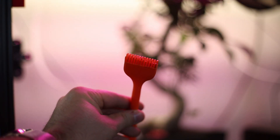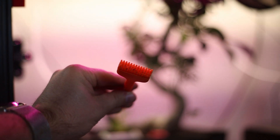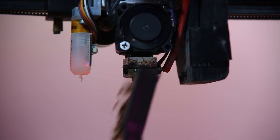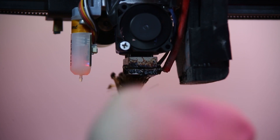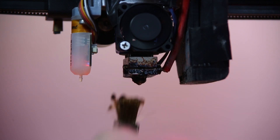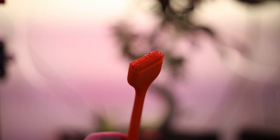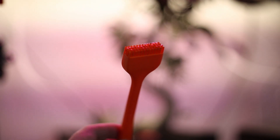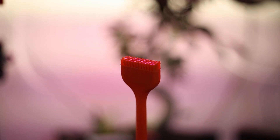As you can see here, after brushing, we did actually get some material off. I did a couple tests with a brass brush just to see if it would remove any more material. In this case, I've got a bit of baked-on stuff that I may have to take a blowtorch to or use a scraper with afterwards. But in general, I ended up with a lot more material than I thought I would coming off the heat block. This is why we want to heat it up to the PLA melting range — because most materials will be soft and have some form of malleability when they are in that melting zone. The goal is to scrape it off and yank it off the block in the silicone bristles instead of having it cure onto your block.